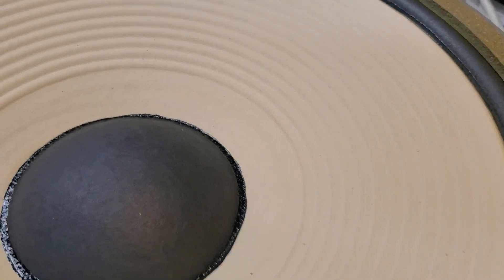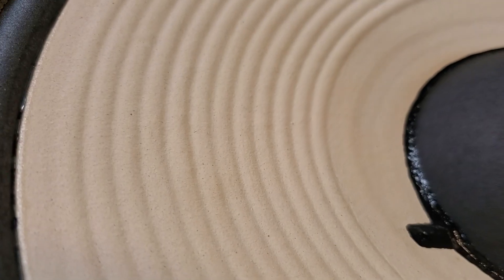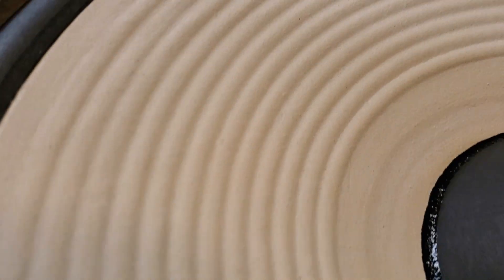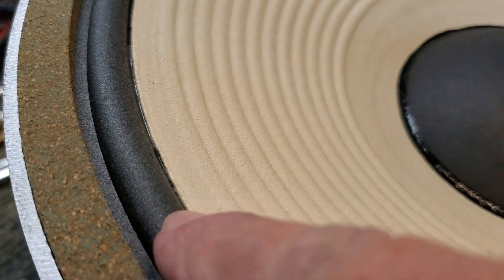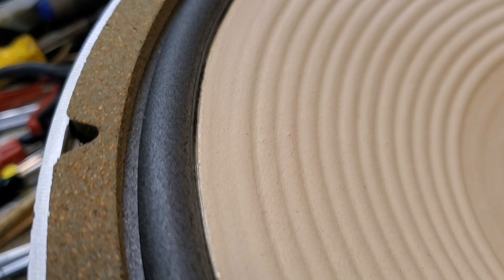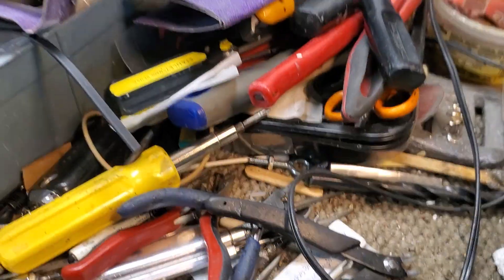This has the white Aquaplas cone, and it's quite a process to build. The way I do it, I take a 2225-style cone, cut off the cloth surround, and then replace it with the correct radius foam surround that is from the 2235, 2234, and the later LE15.